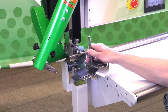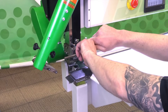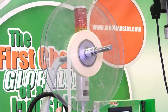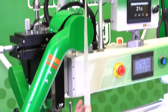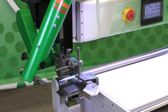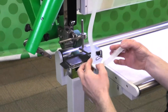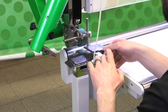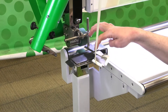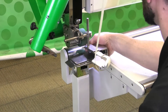With the wedge adjustment done, we're going to put our guide in place using a 3/16 Allen wrench and make sure everything's locked down. Now we're going to load our acrylic tape into place. I like to put a small angle on the tape — that'll help it feed through the guide a little bit better. We'll go down and around and feed it on the bottom tape feed of the guide, not the top overlap piece, but the tape feed.